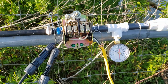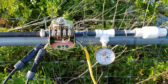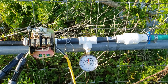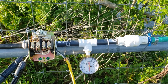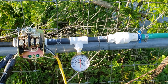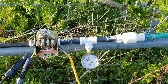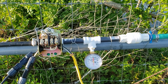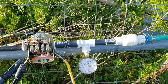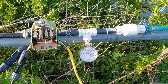The reason I did this is I'm going to put a bigger solar panel on here. The pump in the lake says it has a bypass at about 110 PSI, but when I had it on the other side of the land, it was getting up to 130-140 PSI and actually blowing the little drip emitters out of the drip lines because it would build so much pressure without a ton of flow demand. I eliminated that by making the drippers emit more water, but essentially that was just flooding the trees. Luckily pecan trees can handle that, but not all trees can handle being saturated constantly.